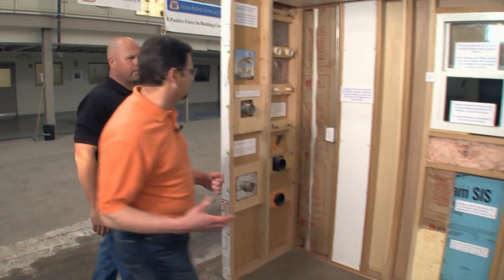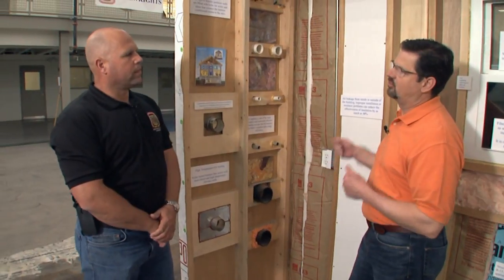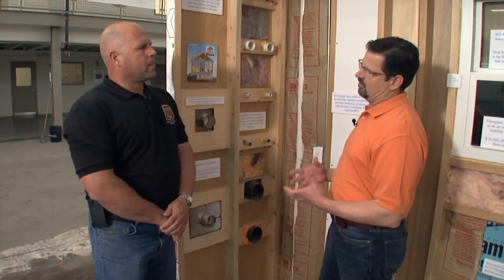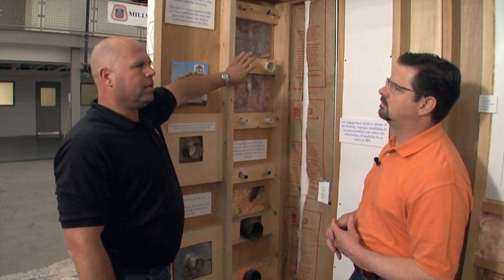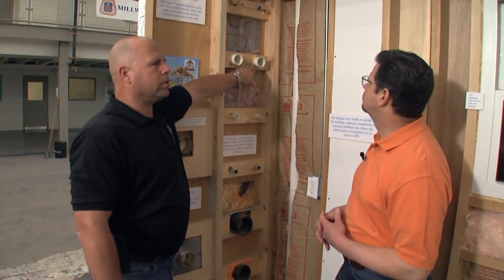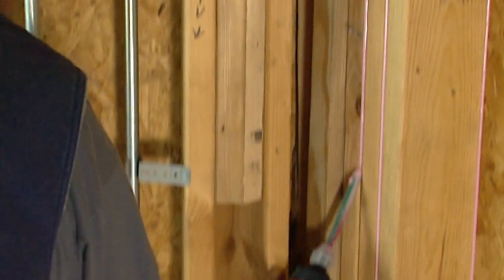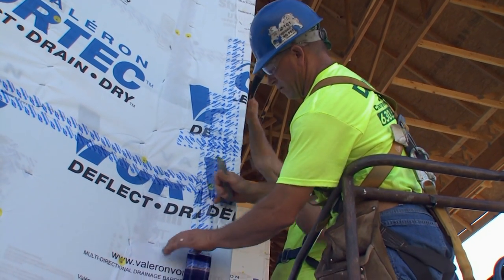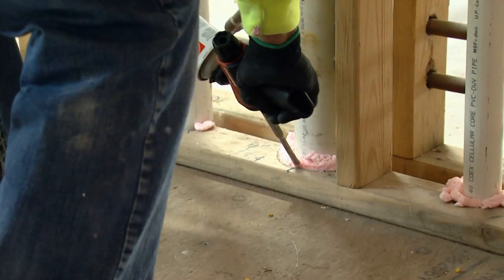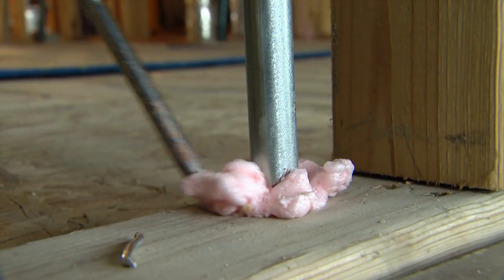Craig, we've been talking about the couple different components of the building envelope — the wall framing and sheathing. Once the structure is built, different trades come in and start poking holes in everything. What exactly is air sealing? Air sealing is basically treating the penetrations from the plumber, electrician, or heating guy — they're going to cut a bigger hole than they need to install their products. What we have to do is seal it up with a material, whether it be spray foam or a fire stopping material, to prevent any airflow going through that opening. So all the steps we took to put the house wrap and everything in place, this just carries that through. Once we install our house wraps and sheathing and materials inside, we have to make sure that all the holes and penetrations are sealed up so we have a comfortable house.